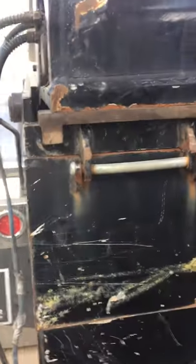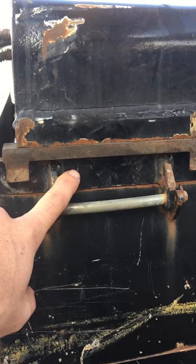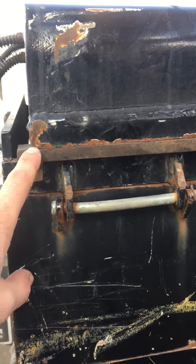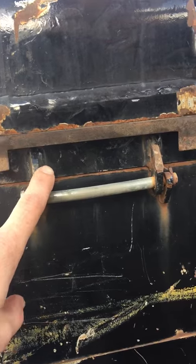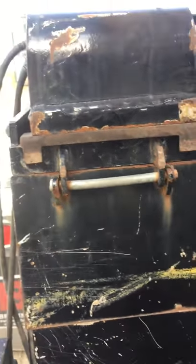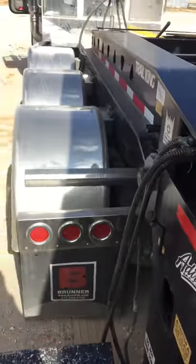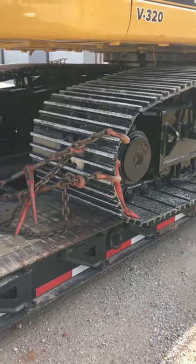On my neck, Trail King makes different heights of these. If you need more height, I carry this plate — because when I haul the 2500s, if I leave this down and use this plate on the main one, I can be legal height, should I ever run the Kansas Turnpike or whatever.